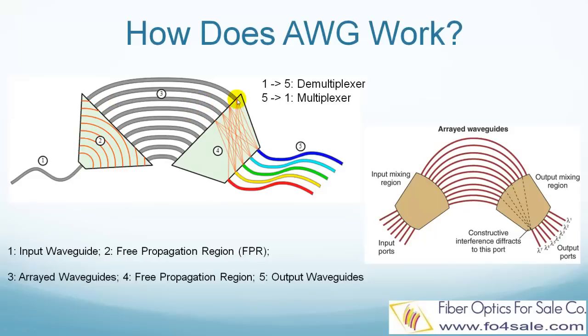Then in the fourth part, each copy is diffracted again and separated into many copies as shown here. At the input edge of the output waveguides, the same color copies interfere with each other. Since each copy has a different phase delay, there is only one constructive interference, so all signal power for that color gets focused there. All other output waveguides also experience interference for this color, but they are out of phase, so no signal power gets coupled into them.